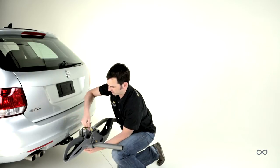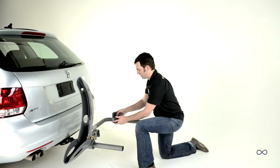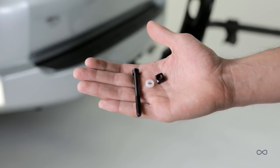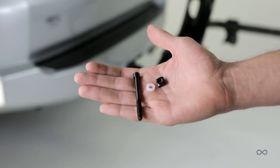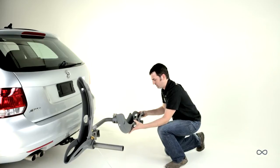Repeat for the second wheel holder bolt. Slide the small wheel holder onto the opposite side of the frame. For small wheel holder assembly, use 1 long bolt, 1 nylon washer, and 1 square nut. Insert the bolt and affix using the nylon washer and nut. Tighten. Repeat steps for remaining wheel holders.